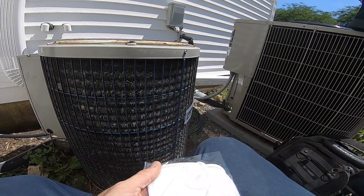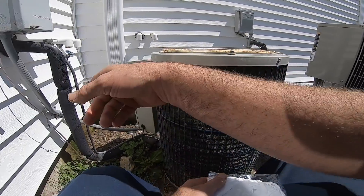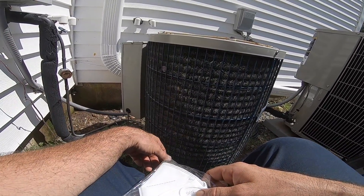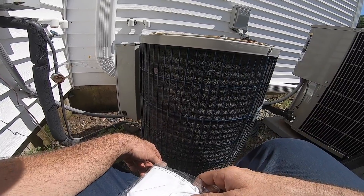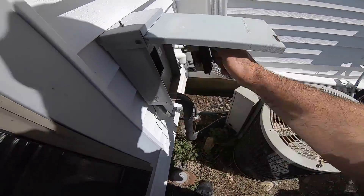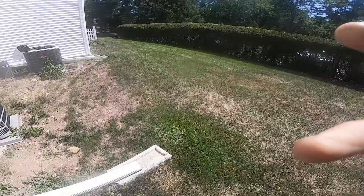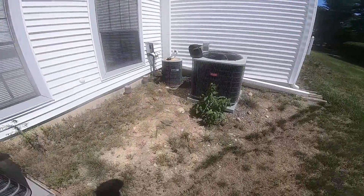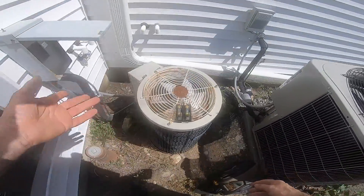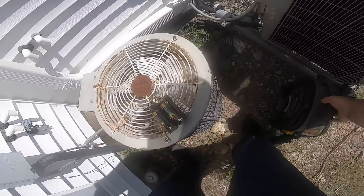Which means I got to put my mask on and go inside just to double check, because the sight glass looks a little ratty and possibly leaking. Let me check the fuses, make sure they're not blown. Inside unit is 80 degrees - this water doesn't have anything to do with my unit. Not sure why they didn't face it this way, but let's see what the electric looks like.